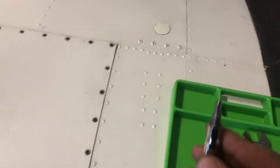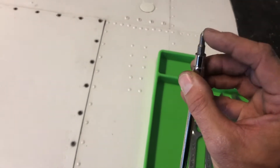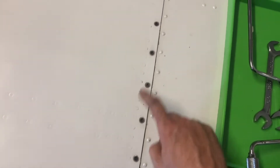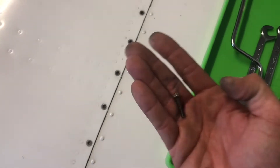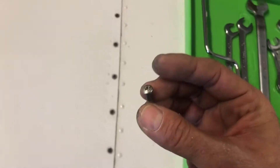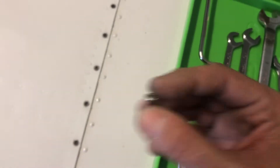I like to use a speed handle with a 45-degree offset bit. If these screws haven't been replaced before, you can put a little bit of valve grinding compound on the top and then push all your weight into the screw as you turn it with the speed handle. We're hoping we don't have to cut these off — if we do, that's a long day. Fortunately this tank's been out before and the screws have been replaced. These are stainless structural screws — that's the upgrade version, and you can't just replace them with a generic screw.